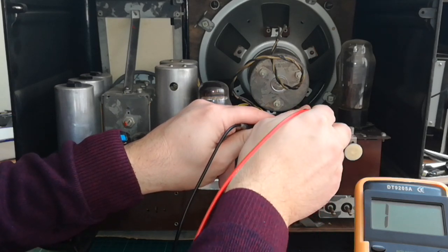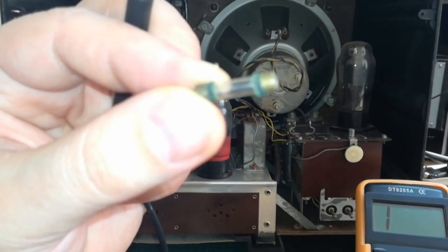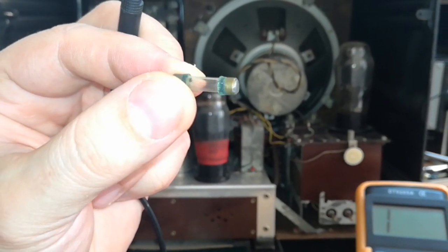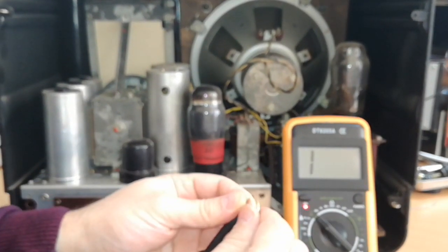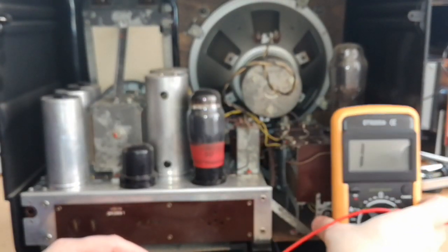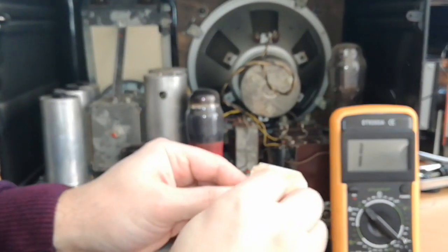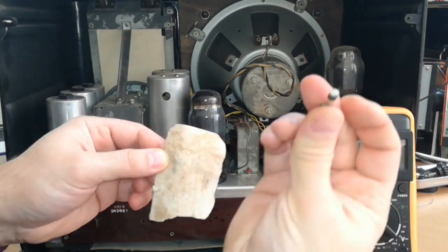We will get a sound like this too. Let's see. It's 70 ohms — this is not okay. So the fuse... the fuse is okay. But if you take a better look, you will see a lot of signs of corrosion on this fuse. And I will try to measure the resistance on it directly. Now it's a better contact. Let's check here — it says nothing. So let's just clean it a little bit, and I will put it back. This now looks much better.